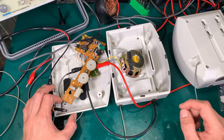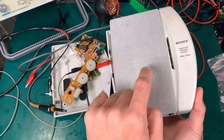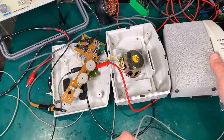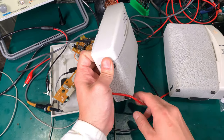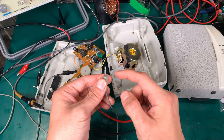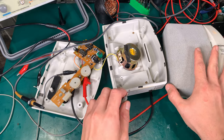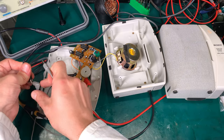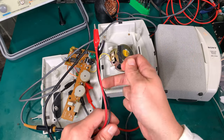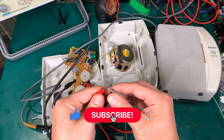Because of that steady tone, I'm able to quickly find the problem. The problem is that this speaker is not working. The most common problem is of course the hardware, and we have to check whether the problem is in the cable or in the speaker itself. So if we grab our signal generator, we can feed directly to the speaker without any amplifier and we should hear a faint buzzing sound.